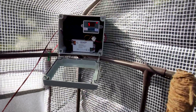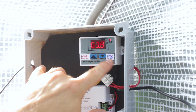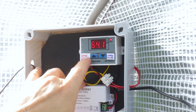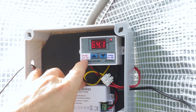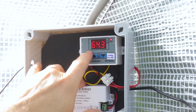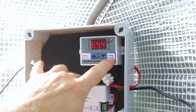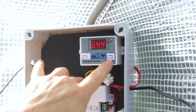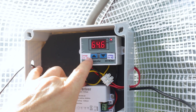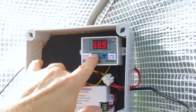The fogger is on and working. There is our sensor. So we've got it running. I'll put these two little stickers on to help me remember which way it is. This is our lower limit on — basically we set our lower limit for when our fogger comes on. This is our upper limit for when our fogger then turns off. The only thing we need to do to adjust our limit is hold down the switch for a few seconds.